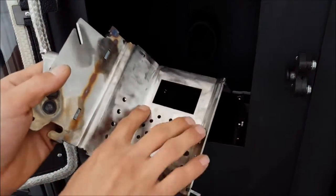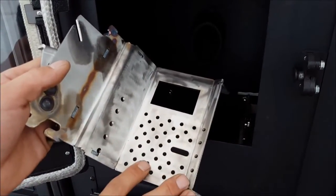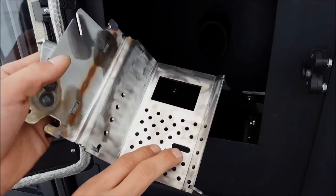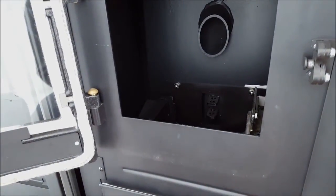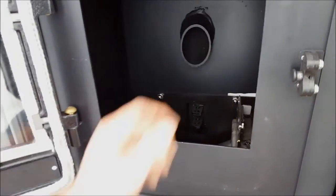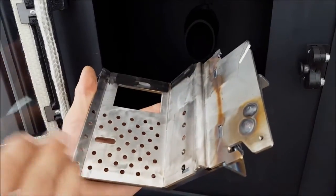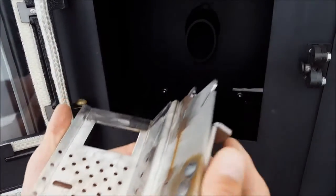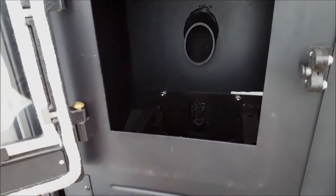You've got your side ports and your bottom ports. This area should be very well kept clean, because if it's not, this will reduce the lifetime of the igniter. Same thing on the right side — the igniter is not in this area, so again, it's critical to keep it clean, but it's not as critical as the left-hand side.